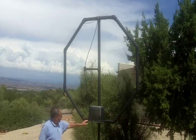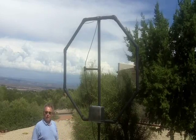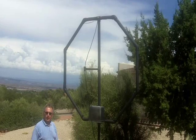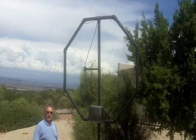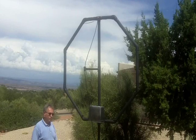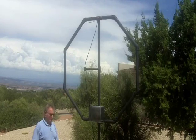The tuner mounted here is comprised of a drive motor system, reversible and forward, that turns a high voltage vacuum variable capacitor, which tunes this antenna to be a resonant circuit — just like having a resonant circuit sitting out in your backyard — which also enhances your receive capabilities and makes a very low noise antenna.